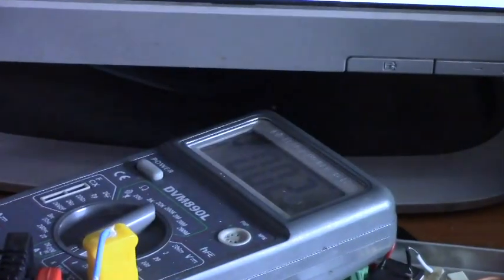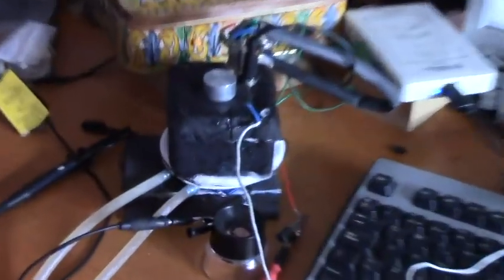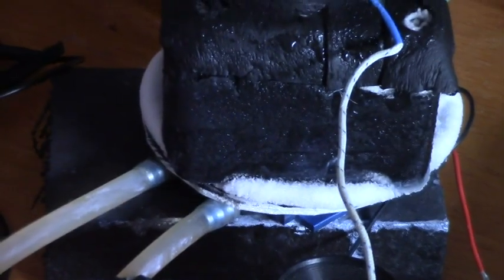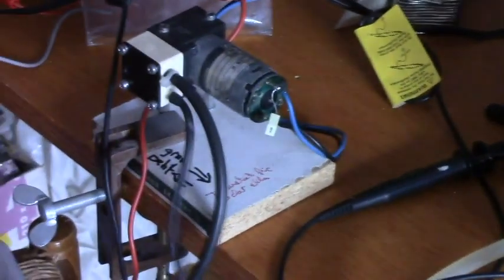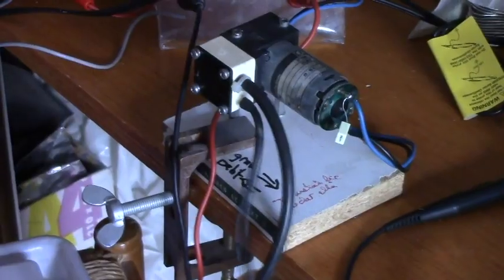The shaped signals are captured with a National Instruments NI myDAQ module running with LabVIEW. Since the maximum capture rate of this module is 200 kilosamples per second, the signals are roughly Gaussian-shaped with a rise time of about 30 microseconds. In the program, an additional treatment is carried out with LabVIEW signal filters, low-pass, high-pass and band-stop, to reduce noise a bit more. Blocks of measurements are taken, and within each block the signals within predetermined thresholds are detected.